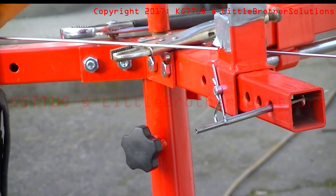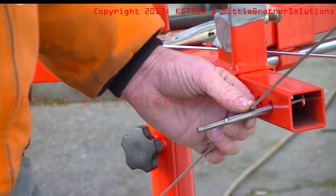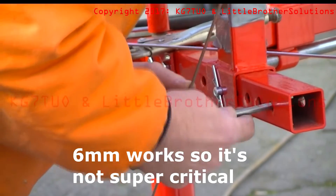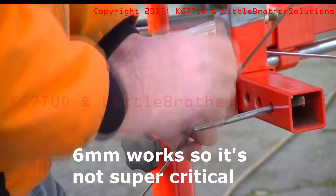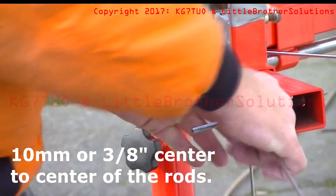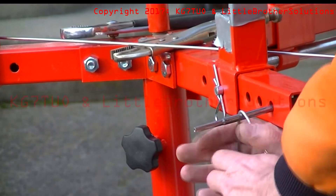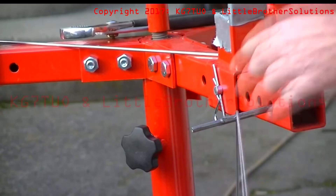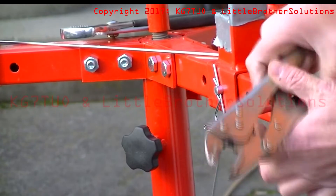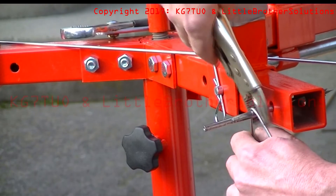When we're done, we'll trim the two ends off. The way I do this is I just sit it over here — I've got this drill bit in here. You want it to be about 10 millimeters across, and I just start the bend right around that. Keep it coming, then take the vise grips and use them to make it go on around that curve.